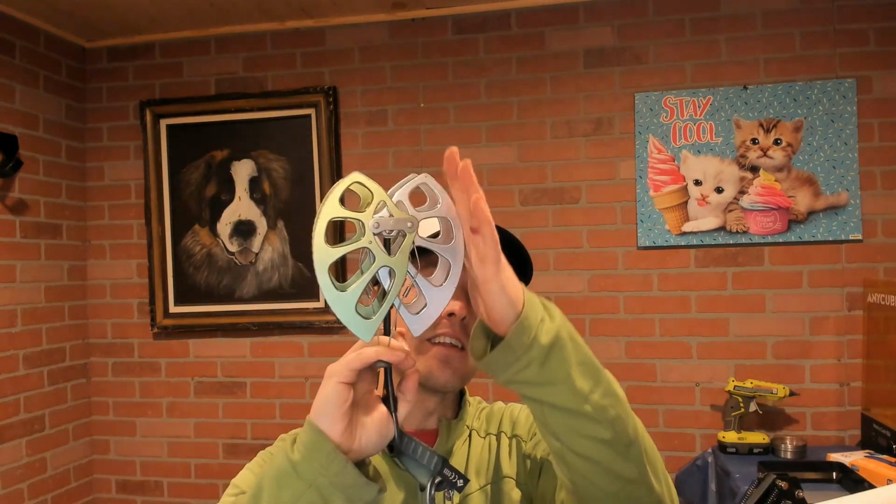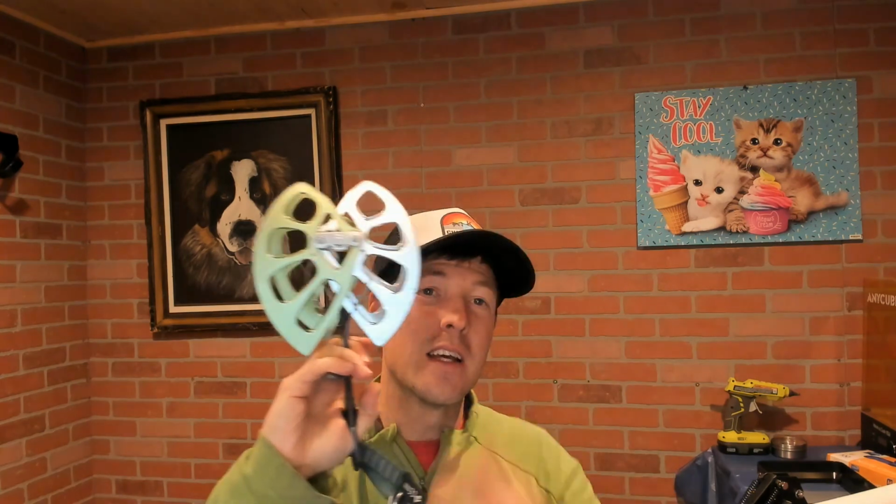So I wanted to build a bike rack that could take any size tire but still grab the front of it. Kind of like a cam can fit in any size crack when you're going rock climbing. And it does that based on the angle of the lobes. They basically have a logarithmic spiral that allows them to continuously have the right amount of friction, regardless of how wide they are open.